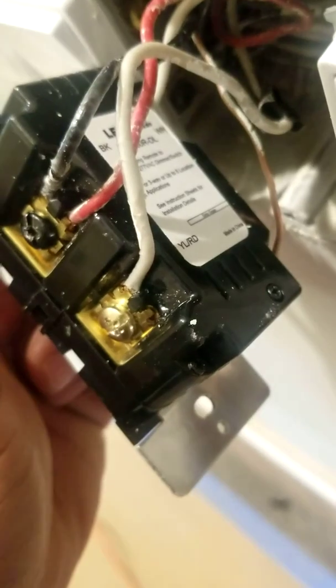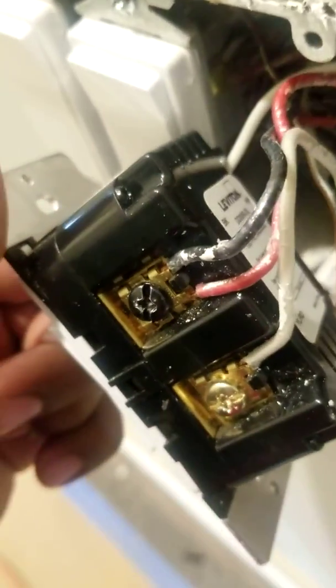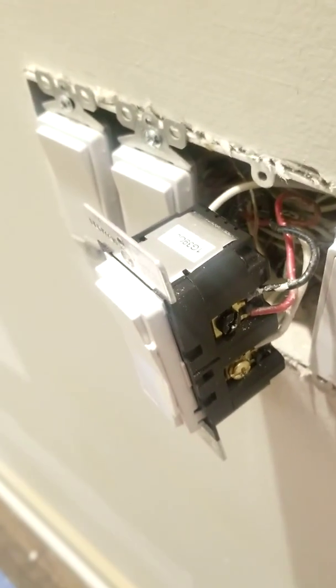Down at the bottom you can see my YL-RD — that's my first traveler wire. If you have this model, you will not have an RD on the side; you're just going to have the neutral and the ground. So what do you do with the second traveler wire? You put it on the same terminal as the BK wire. You can pigtail those two together and then put one wire on the BK terminal. Either way it'll work. My line-in is going to the BK terminal, and also my second traveler wire — and this is at the line box, where the main line is coming from the electrical panel.